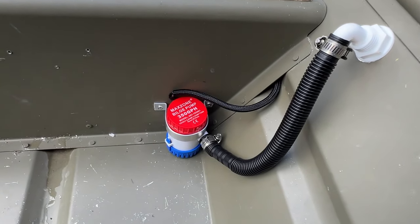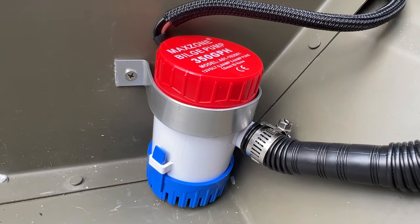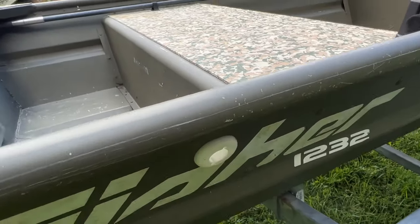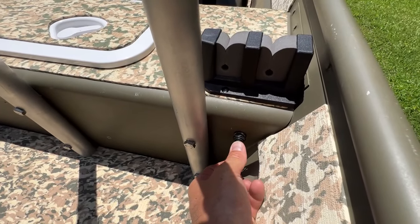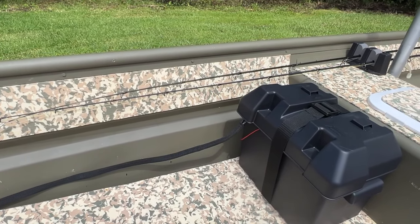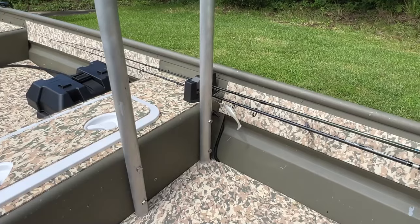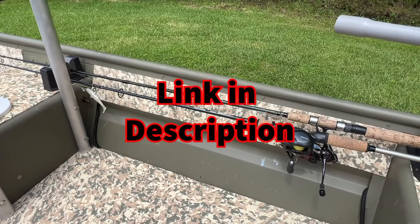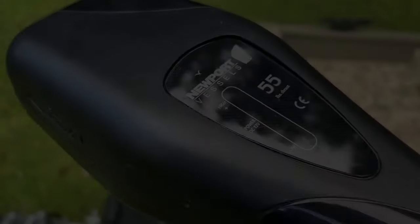I identified that this boat needed a bilge system — if I get caught out in the rain I'd have nowhere for the water to go. I went to River Supply, picked up a small bilge pump, made an aluminum bracket to hold it in place with a couple of screws fastened to the back of the bench seat, ran wires up the side of the boat to a simple waterproof toggle switch, and that small project was done in a blink. Right after that I rolled into rod storage — I didn't want upright holders since I plan to fish under docks, so I found horizontal rod holders on Amazon, mounted them with simple screws, and they look great and hold the rods securely in place.